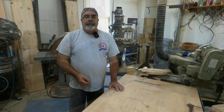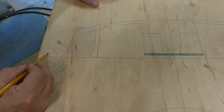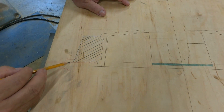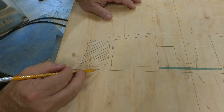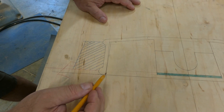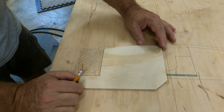Let me show you the layout and we'll show you how we're going to go about building this. So over here, my red line — that's going to be the parting line, that's where we're going to part it. We're going to have to core this part out — this blue section is going to be a core so that we can capture this here and this here. The upper part frees up getting the sand out of the mold, and all of this will come out also. We're going to do the inside first, flip it, and then turn the outside. I made a little template that's going to be my guide to finish the inside.